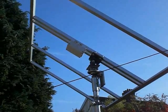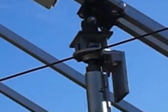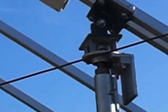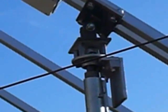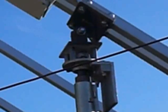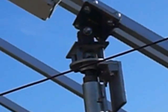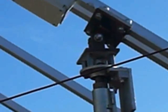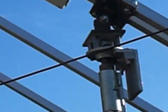I'll do a quick rundown of what I've done so far. This is the bracketry which is actually going to be holding it all. I've actually converted a brake drum — I had an engineer do it for me, and he's done a lovely job on it. It now swings round in the breeze very easily, so when I use the actuator on it to move it, with the control and the sensor and the light sensor which I'm putting on it, that will move round very easily. This is very important to make sure it moves very easily. I'm on actually two tapered roller bearings, so that will be beautiful.